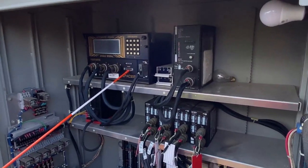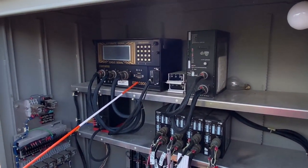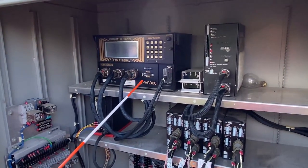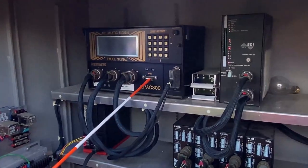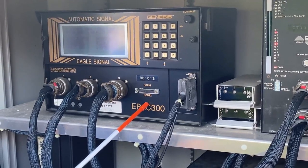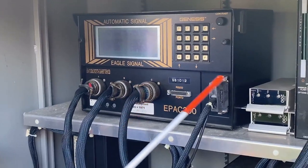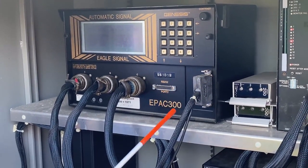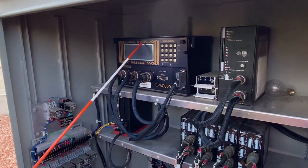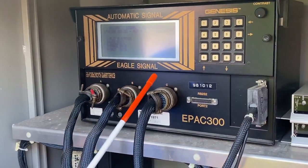As part of the class, we've been working with an M60 controller. What we have here is an M11, and this is an older TS-1 controller. The reason it's TS-1 is because all I have is a port 2 — I don't have the SDLC port or port 1. That's what connects the SDLC bus. I have to use my A, B, and C connector, and then I have my D harness, which goes for my preemption. So this is an older controller — you'll see it's got the push keypad.